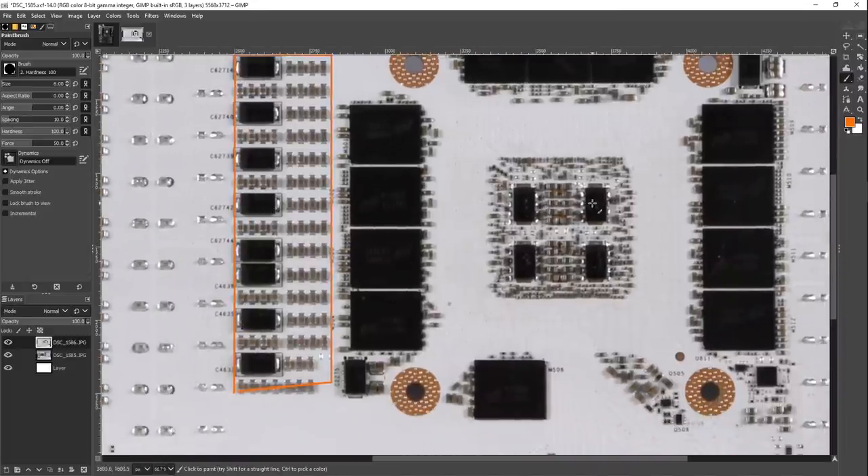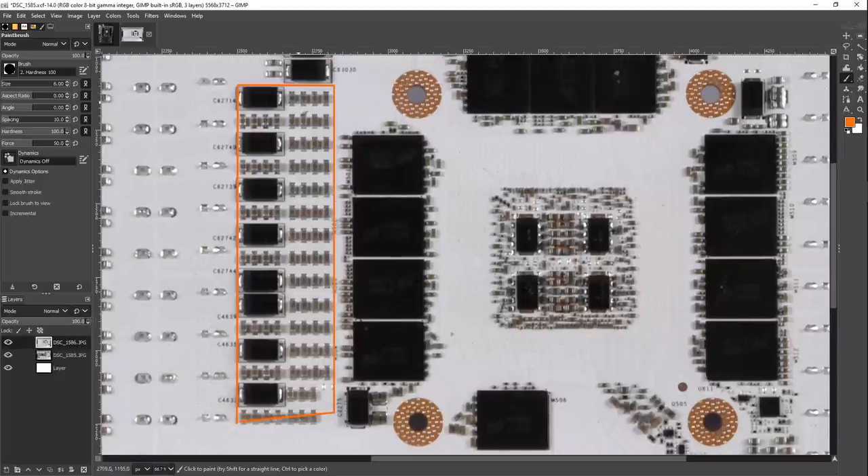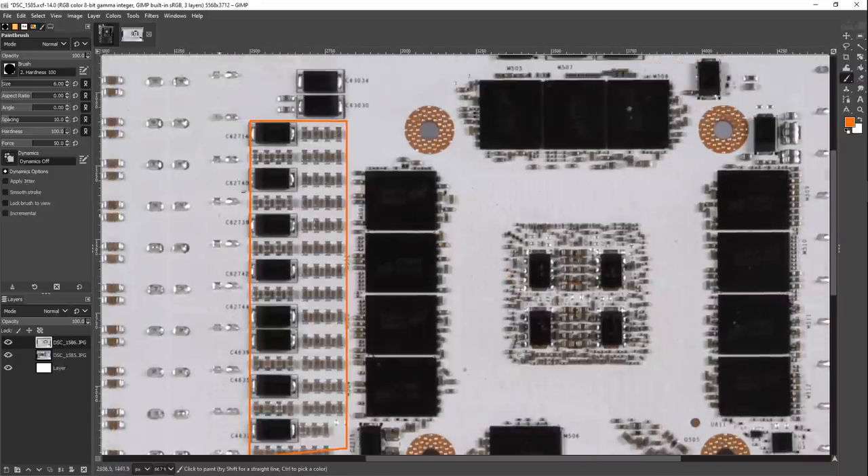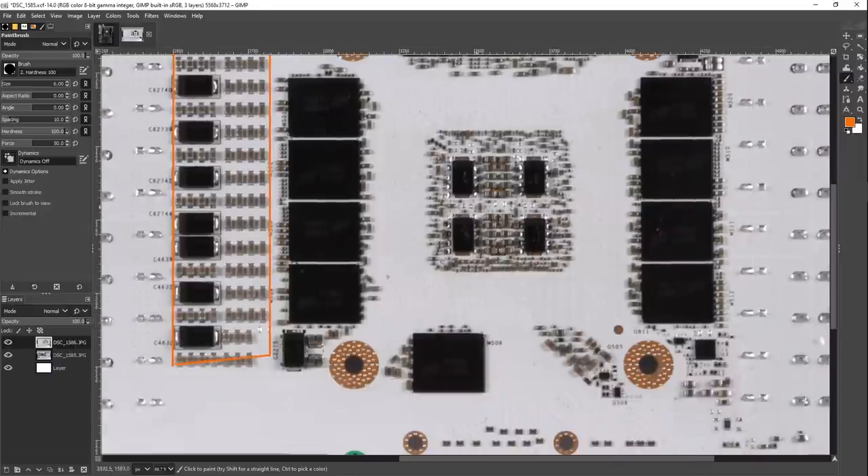The priority with multi-layer ceramic selection is that they have a lot of capacitance, low ESR and low ESL, but the temperature stability isn't necessarily that great. Obviously, if you're pushing a card on liquid nitrogen, this whole area on the back of the card is going to get really, really freaking cold. Potentially, the effectiveness of your regular multi-layer ceramic capacitors is going to be significantly reduced. On the other hand, polymer capacitors don't care anywhere near as much. There are still some effects on polymer capacitors from low temperatures, but they're nowhere near as large.